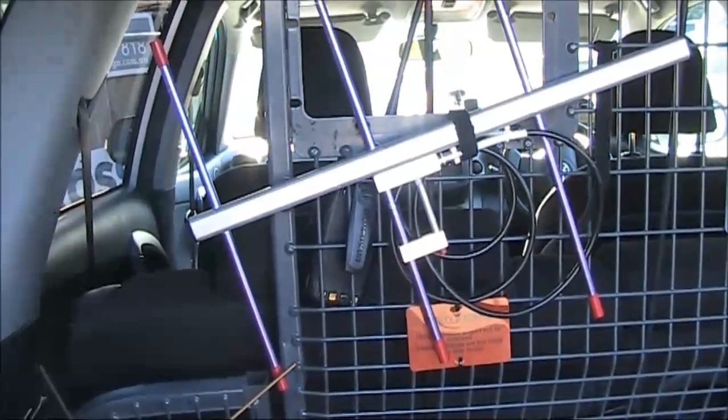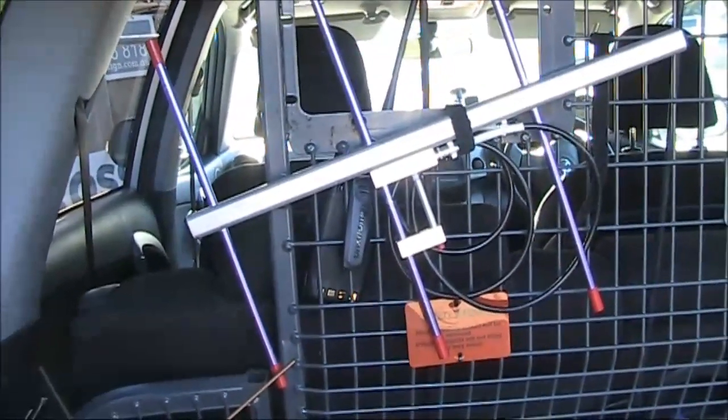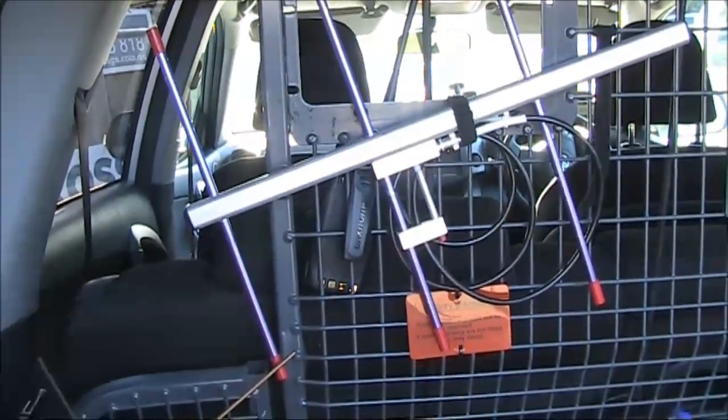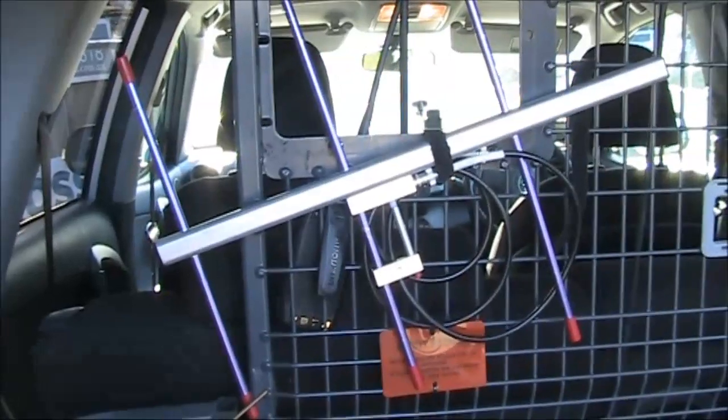And then when you get really close, what happens then? The positioning is pretty good down to the ground. We'll generally use the position reported by the payload. However, the Reedy payload is very easy to DF. So, for example, I've got a 3-element Yagi in the car, and I've got a sniffer in the front of the car, which I can use to find it.